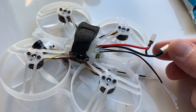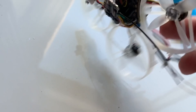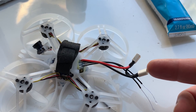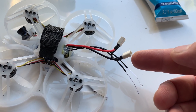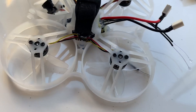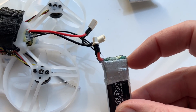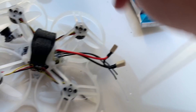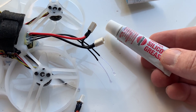I've got the power lead on here and it's going to be 2x1S — this is going to be a 2S drone because this is basically my Shutterbug 85 formula. But instead of going with an XT30, I decided to go with 2x1S. The reason has nothing to do with the connectors — it has to do with the batteries. If I had a regular 2S battery I'd have to worry about both the XT30 and the balance plug, with a lot more chance for moisture to get into the battery tabs. But with these 1S batteries I can just seal up the top of the battery with clear silicone. The only part where water can possibly get in is the end of the connector, and for that I can use silicone grease — the kind of stuff you'd use on spark plugs. It won't block the signal, but it will block the water.